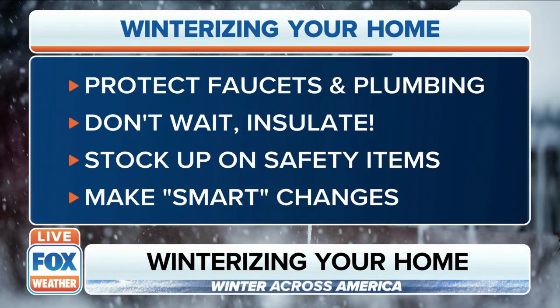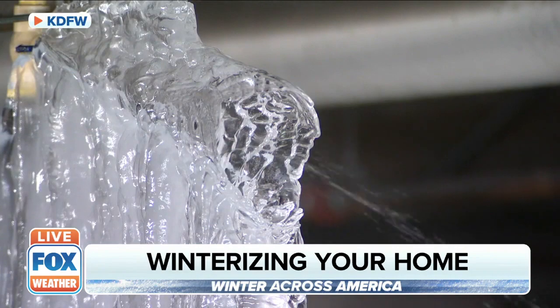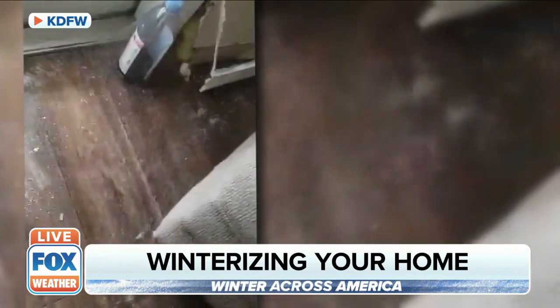It's so important to seal the envelope, as I like to call it. I've got some easy tips today that anybody could knock out in one afternoon, and it's really going to save you in the end. These are really important — if you haven't done these already, get started and do them now. Let's start with this water pipe heat cable. If you have any pipes that are exposed or even in parts of your house that might not have heating, you run this heat cable along that pipe. It has a built-in thermostat, so as temperatures start to drop, it's going to kick on and keep your pipes from freezing. Pick up some electrical tape, because you'll be attaching it to that pipe every six inches. It comes in many different sizes and lengths, and it's going to be a saver when it comes to preventing burst pipes.